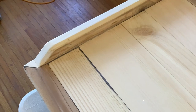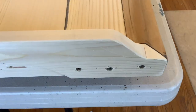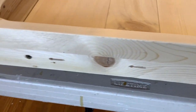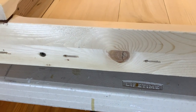All right, enough of the sanding — let's get on to the next step. Some of you are probably saying, 'Brian, those perpendicular boards have an end board on them — how are they supposed to expand and contract?' Well, here's the solution I came up with: this first part has three screws in it and it's been glued, but for the other boards that it attaches to I put these grooves in, so I'm going to screw it and they'll be able to expand and contract.